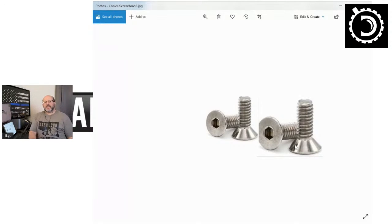So as the screws tighten this thing, the ring halves can move laterally with respect to each other. And I've seen that bind parallax and make a magnification adjustment very stiff on a few scopes. And also because it not only deforms the tube, but it also cuts down on the engagement surfaces on the scope tube. And I've seen scopes slide, although they're torqued correctly. So you've just screwed up your adjustments and parallax and deformed the tube, and it's still not holding it very tight, right? So that is kind of a problem.